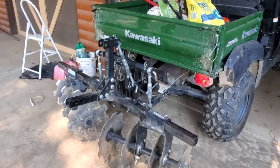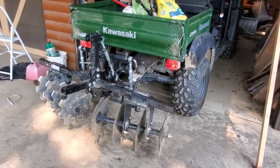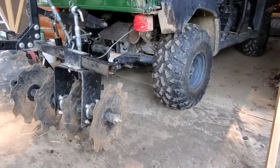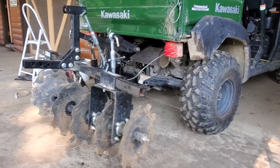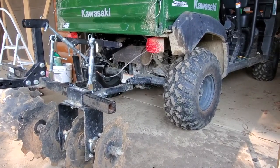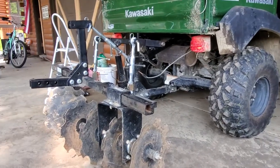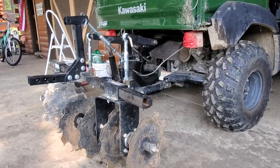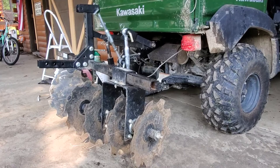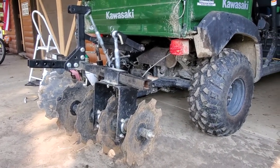Now I'm going to show you the down pressure. It's not as powerful as a hydraulic cylinder — it's just electric — but it's enough to put a lot of pressure if you're using the Cultipacker or the disc. At least enough to get the job done. You'll be able to see the suspension come up as the weight of the disc presses into the ground. As she moves it down, watch the suspension — you can see it starting to pick up. That's plenty enough to work the dirt. It's slower than hydraulics, but it works very nice. And there's a clutch so you can't over-raise or lower it too much — it'll stop. That's the down pressure; I'll show you how it works out in the food plot.